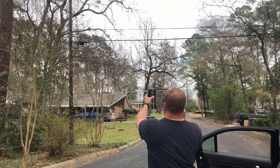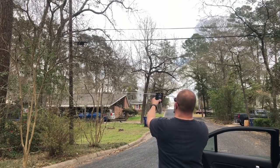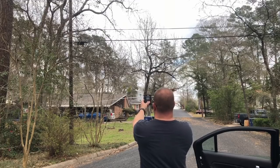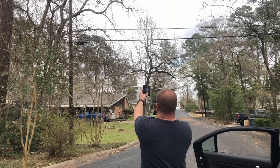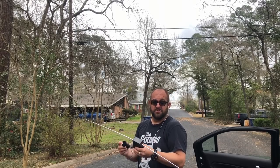Now I'm right around the corner from that last clip, and somewhere in this area the noise is just stupid high — absolutely bonkers. We're peaking 60 to 80 on the meter depending on where we're pointed. So that's the noise I'm hearing at home and it's coming from around here. Could be a grow light, could be a transformer — I don't know yet. But I'm going to employ one other weapon: the tape measure Yagi with the 705.